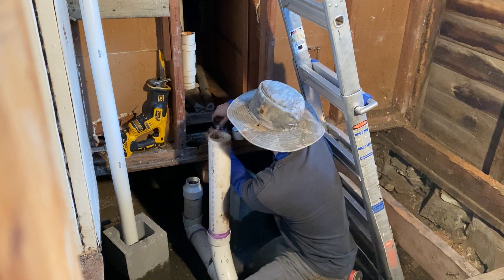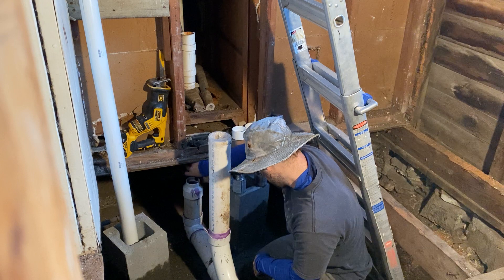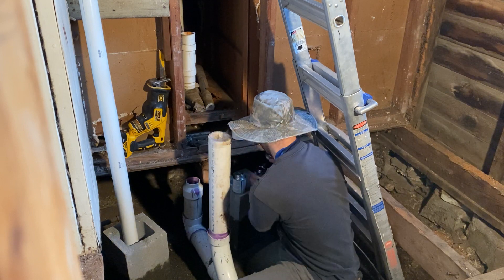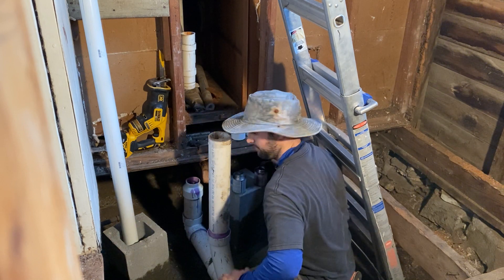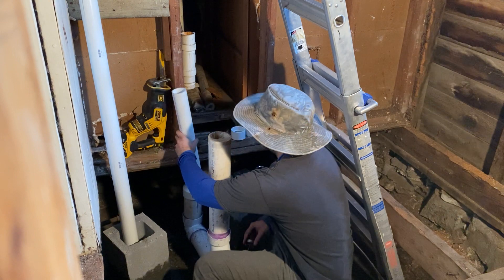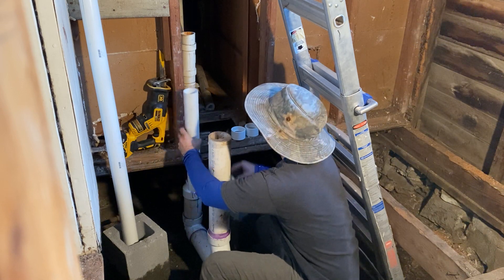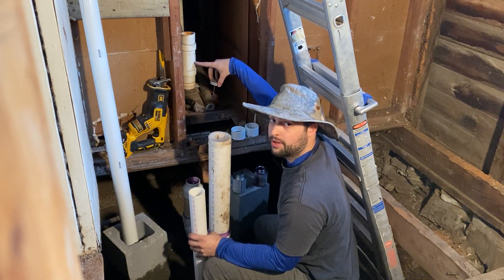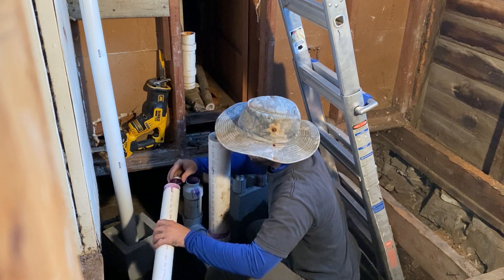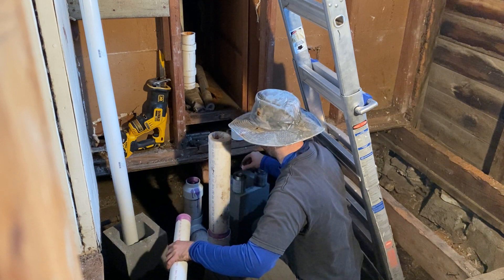First I'm going to take these lids off, and if you can't get it off, just use a pair of pliers or channel locks. First I'm going to clean the inside of this two inch reducer — from a three inch to a two inch. I've got a piece of pipe right here that I've already measured to go right here. All I'm doing is linking this from the reducer with a stretch of pipe going up to the kitchen sink, and it goes straight up through the roof. I've already got this cut and I'm about to put it together.